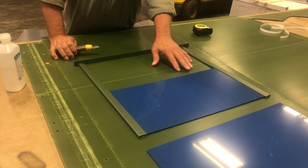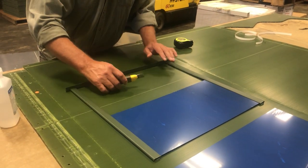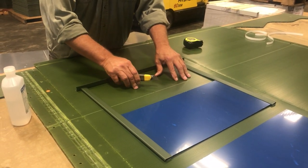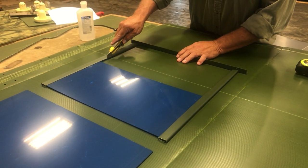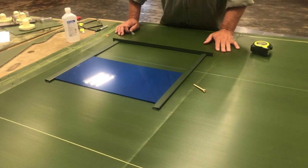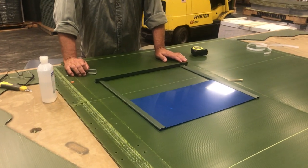Now that you have the mark, you can either take the glass clear out or use the glass as a straight edge and cut along it. Keep in mind when you cut this material it's always better to make light cuts and make multiple passes — if you try to go through all the way with one cut it's hard to keep it straight. Cut along your glass on the bottom, then use your tracks as a guide on the sides. It's better to have your windows laying on a flat surface when cutting — you do a neater job than if the blind is already assembled.